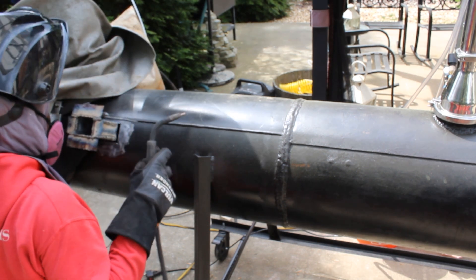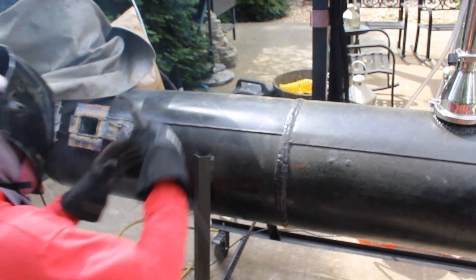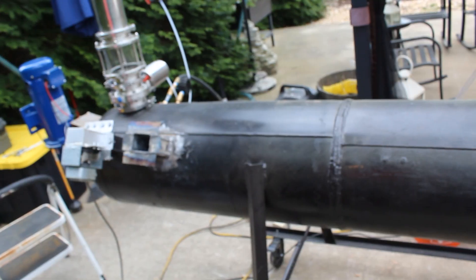Nonetheless, I went ahead and installed this one. I already had one on there from a previous day where the camera had run out of space so I couldn't get that footage. But since they're all the same, you can see me build this one: cut out the sheet metal, weld it all together, have the flanges, drill the holes — then rinse and repeat. You can see the completed waveguide there with the magnetron already mounted next to it. Unfortunately the camera lost focus, and some additional footage afterward was lost due to an SD card issue — but essentially all that was was mounting the other flange of the waveguide to the face of the one we just welded to the chamber.